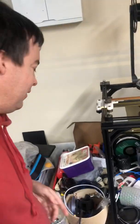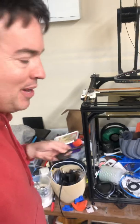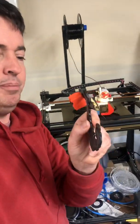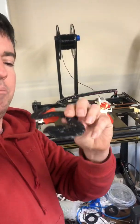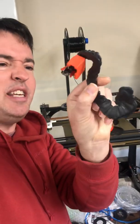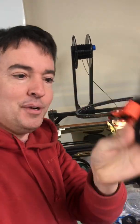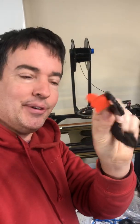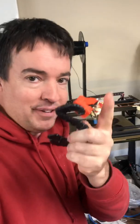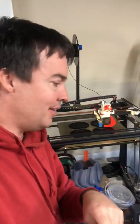Mine did have insulation, but how about this for an epic fail. I printed something in polystyrene and it came adrift from the bed. Most people get spaghetti when their prints come adrift, but mine was a lovely big melted sticky mess which ripped off the silicone sock in the process. So that's why my heat block doesn't have a silicone sock on it anymore. But I hope I've just proved the benefit of the silicone sock — it helps to prevent the airflow from cooling down the heat block.